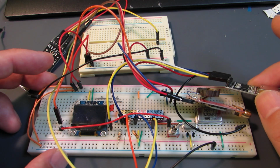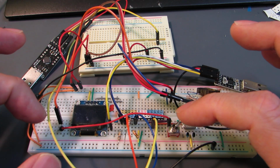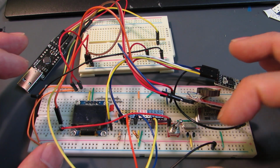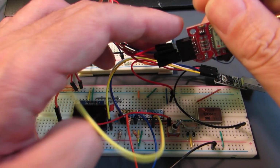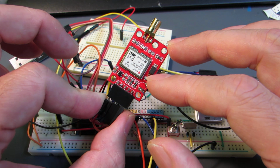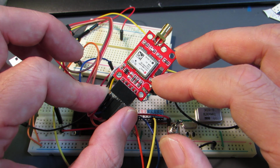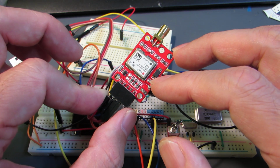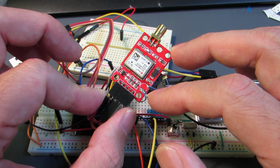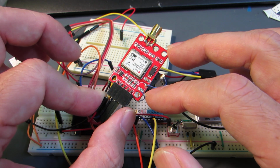As I presented before, I changed my mind to get the high precision not from inside but from the external, from the sky, from the GPS. As I said in the previous video, the GPS module Neo 6M can generate a very highly accurate GPS-trained clock up to 10 megahertz, not only the 1 hertz every second clock, but also up to a 10 megahertz clock.